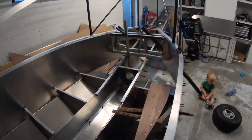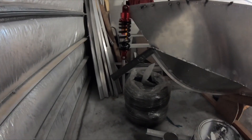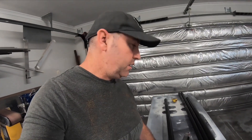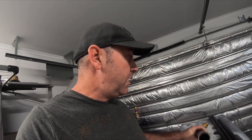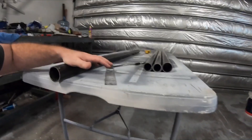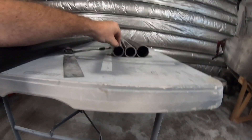Today should be good. I've got the front one I'm going to work on today as well. With this front suspension landing gear, the chromoly is super strong stuff. The actual tensile strength of this is 95,000 pounds per square inch, and yield strength is 75,000 PSI. Elongation is 10 to 12 percent, so super strong steel.